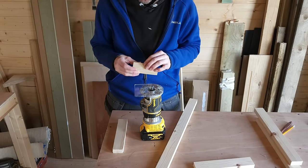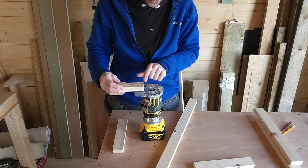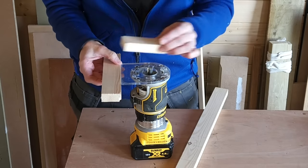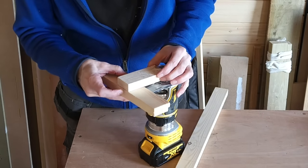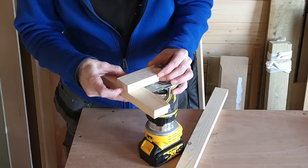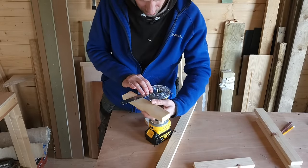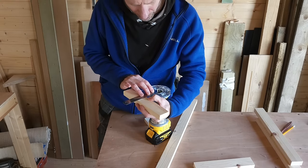The way I got the measurement for this spacer is by measuring the distance between the edge of the cutter to the edge of the piece of timber I want to make a lap joint out of. I place the spacer along the edge of the base and then to the edge of the cutter — that is completely flush and exactly the same distance. I like to use a steel rule for this kind of measurement: put it on the base, put the timber up against there and up against the cutter, and then measure that distance.